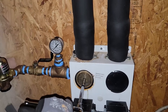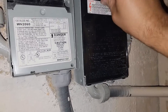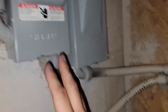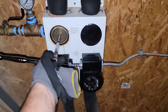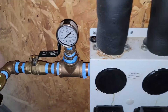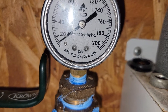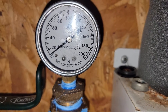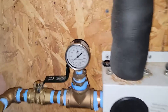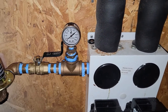Let's turn the geo unit on, get it back running — let's get the power back up. Pumps just came on. Pressure looks like it is up from zero to about 10 PSI. So the pumps are on. Now at least we can maintain a certain amount of pressure so that we don't have hot pumps and we don't have a high pressure issue with our geo unit.